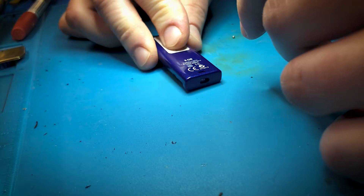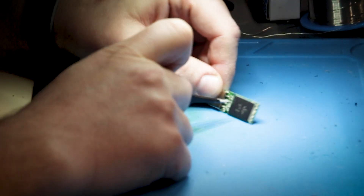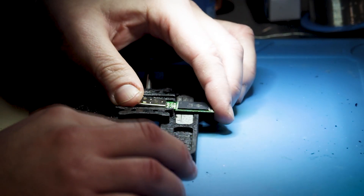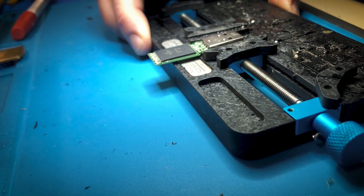Got another case of flash — I got two more coming after this video. This one can be quite simple. It's just an 8 gigabyte Lexar, product of China. Here's the drive — simple configuration, controller and one TSOP chip. The controller is an SM3253L, very simple to work with. It's gonna be a simple job. I've already tested the drive and it just shows the controller serial number, but that's about it.